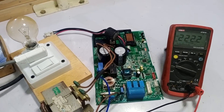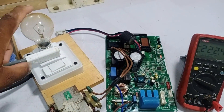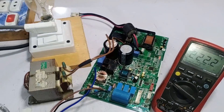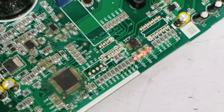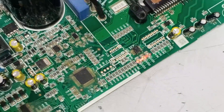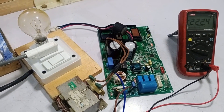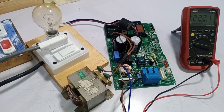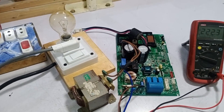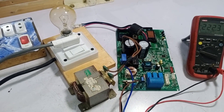The high side of this circuit board is completely fine — there is no issue there. If this circuit board had a problem, the bulb would have kept glowing or could have fused, but no such thing happened. The light of this circuit board is blinking, which means the circuit board is fine and its SMPS and microcontroller are working correctly. 222 volts are passing through the circuit. Testing the circuit board with the series board is beneficial and has no real cons — just work with safety.